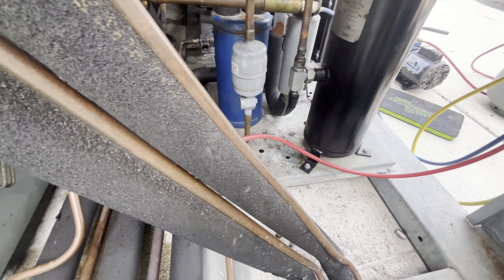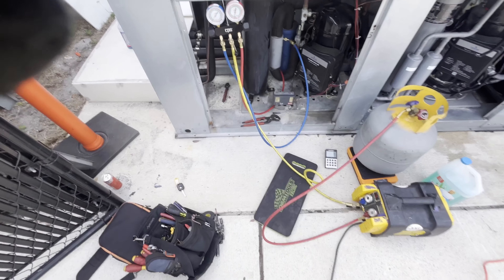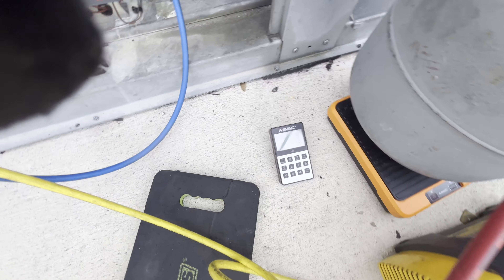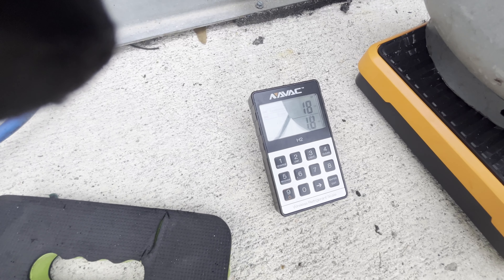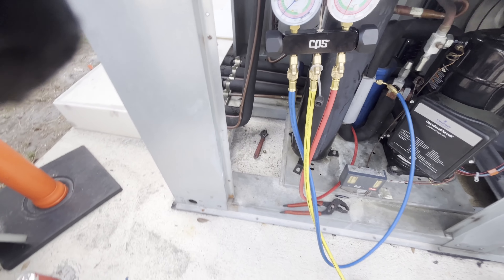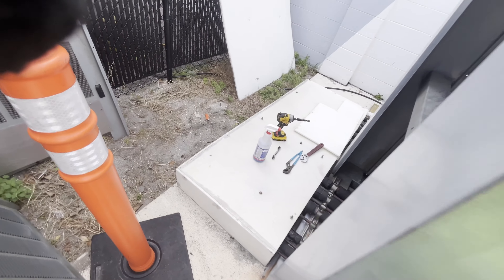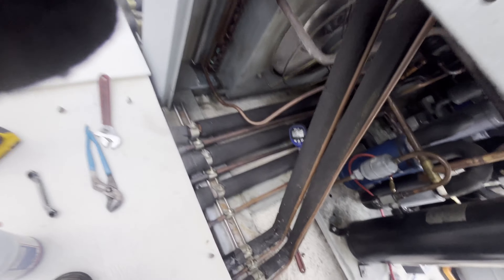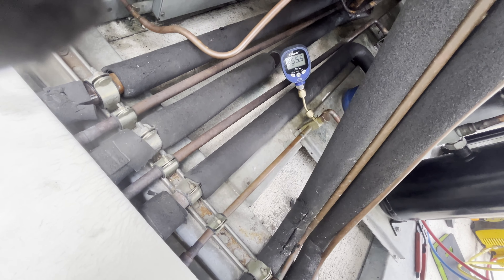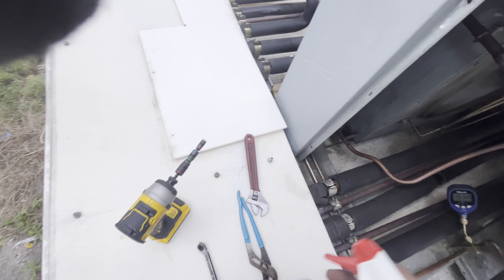Just use my time wisely when I'm here. That's pretty fast — I pulled out exactly 18 ounces, nowhere near the 47 pounds I can hold. I'm at exactly zero pretty much, and still got 155 psi in the system going to the evac.